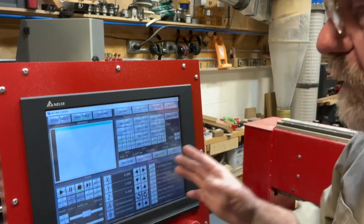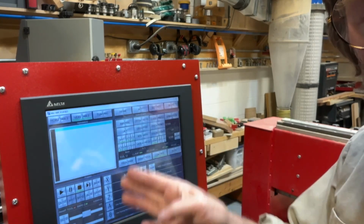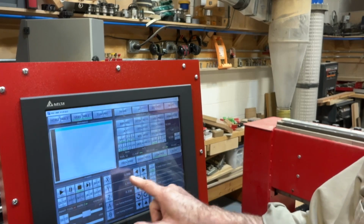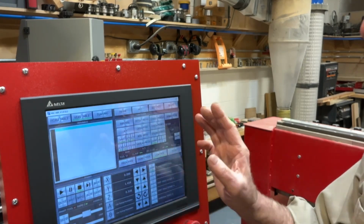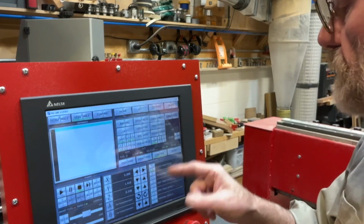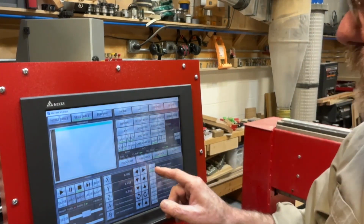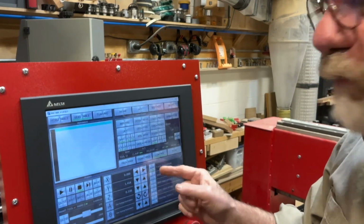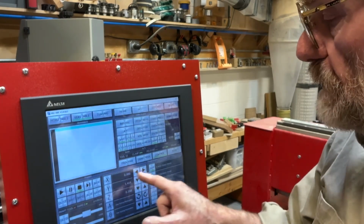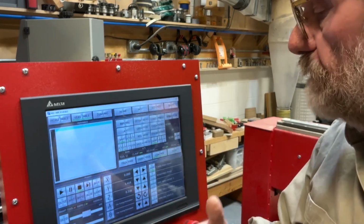So now I'm there. The spindle is moved to where the center of the shaft is at the edge. So I'm ready to zero that out. I've set that work offset. I actually already did zero that out. Okay, so once we've moved it forward 1/10 of an inch and then set that to 0, this is the 0 point or the back of my part.